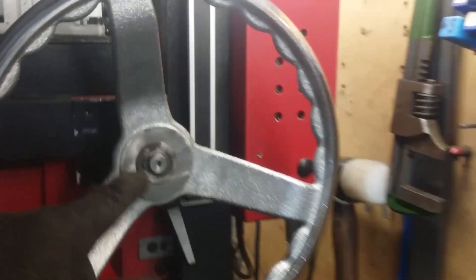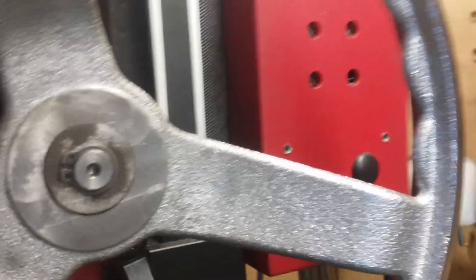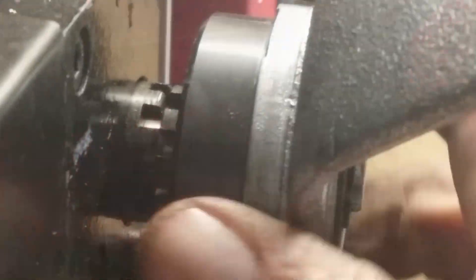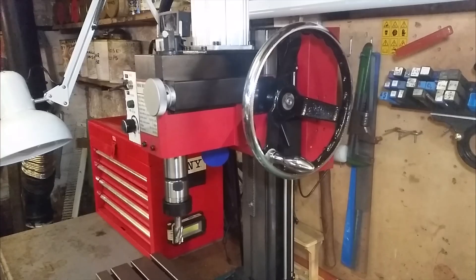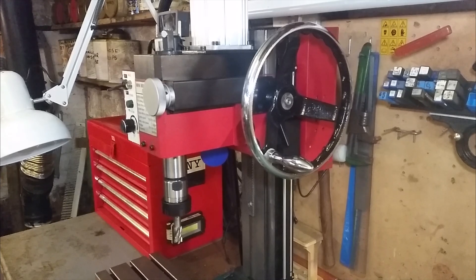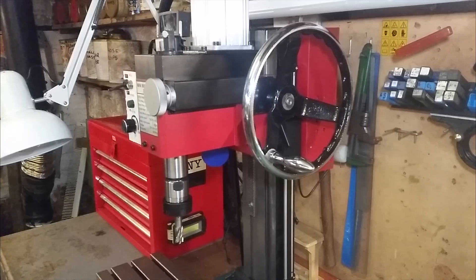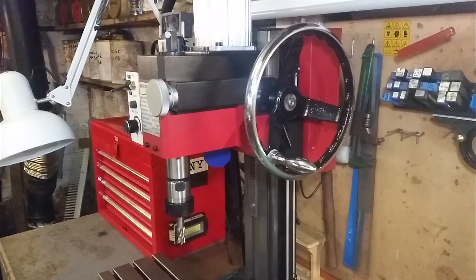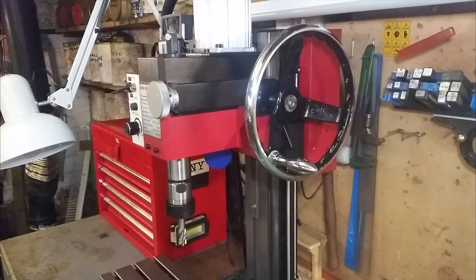Managed to get a washer on there. I think that's a better solution than just having that snap ring bearing directly on the speed wheel itself. It comes out, at which point it rolls the head up and down as it should — very nicely indeed. It links in there and then we're on to the fine tune. It clearly needed a drop of paint to set it off — unfortunately I only had gloss, really it should be a satin finish. I have some satin on the way, and I'll be fitting two smaller metal hand wheels to the table. That may be the next video, or it may be fixing my lathe, which seems to have developed some startling noises.